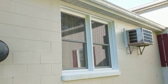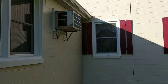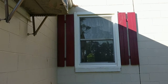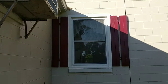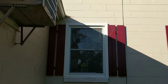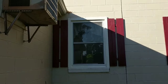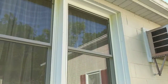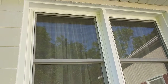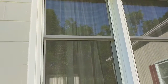So that's what the new window looks like. That's what the old windows looked like. You've got the wood sticking out beyond the plane of the wall. Water was getting in at the top, of course, because there's no flashing at all — just that metal wrap and a bead of caulk. Now there's no way any water is ever going to get in the top of those windows, unless it leaks down through the roof through that cinder block header right there.